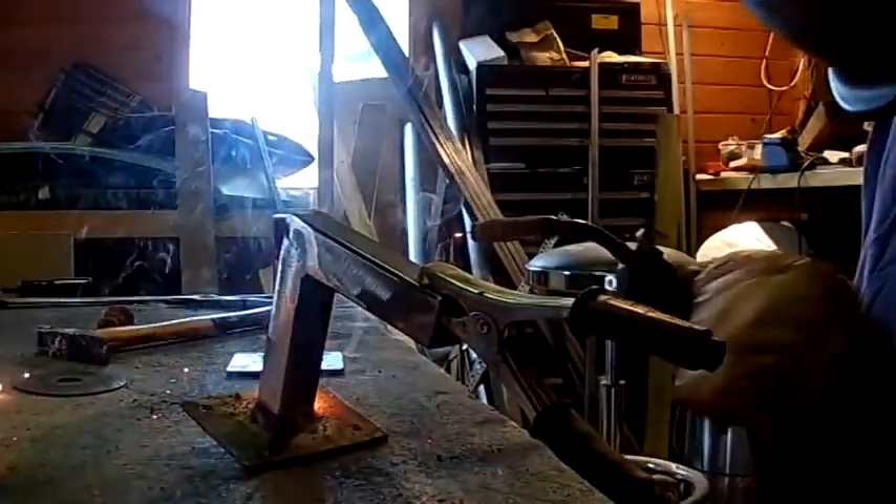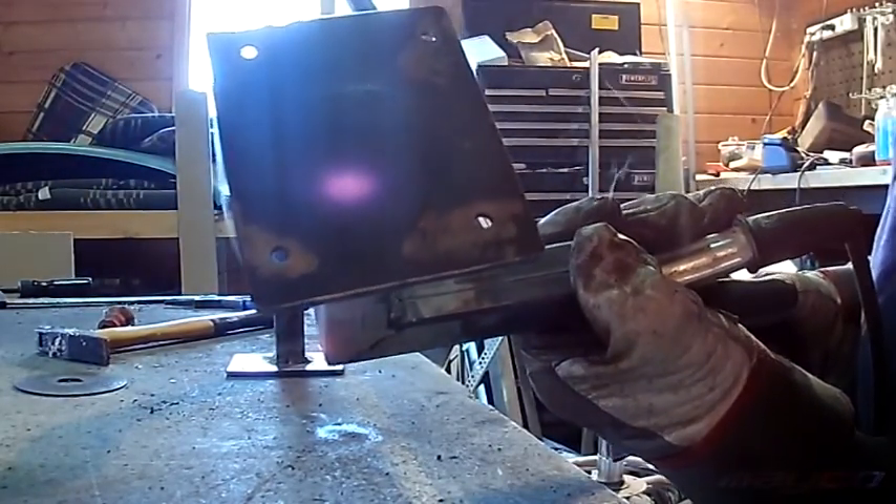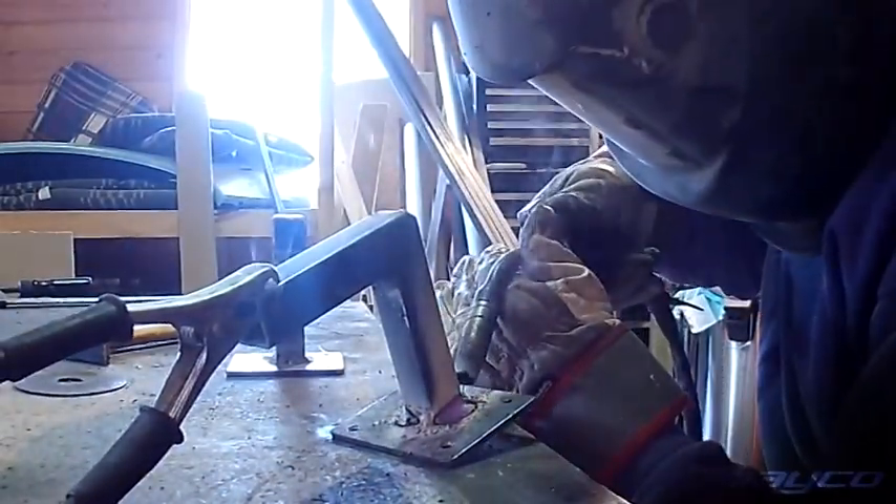A professional welder runs between 1,500 and 3,000 euros — a good range for a professional machine. I don't need a professional welder, so I've set my budget to a maximum of 600 euros. Here come some of the specs I want: I want a MIG welder suitable for gas, and I want a welder that has a coupling connecting the torch to the machine — a euro connection.